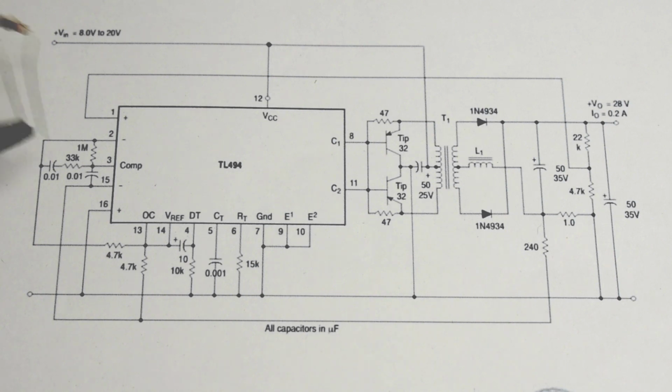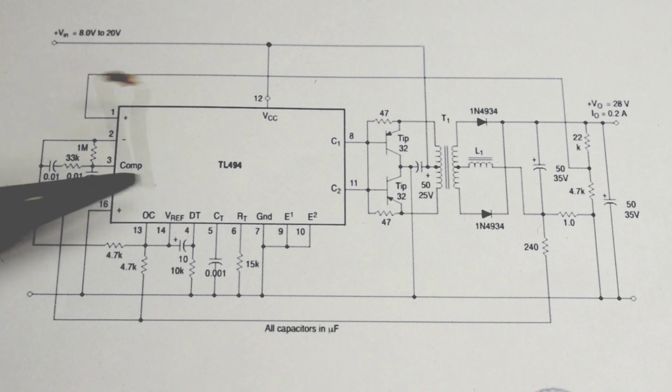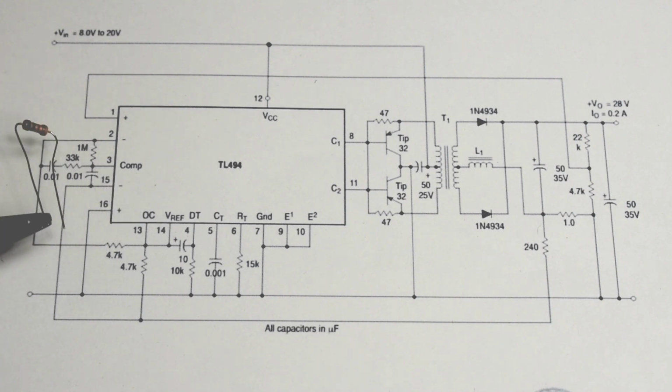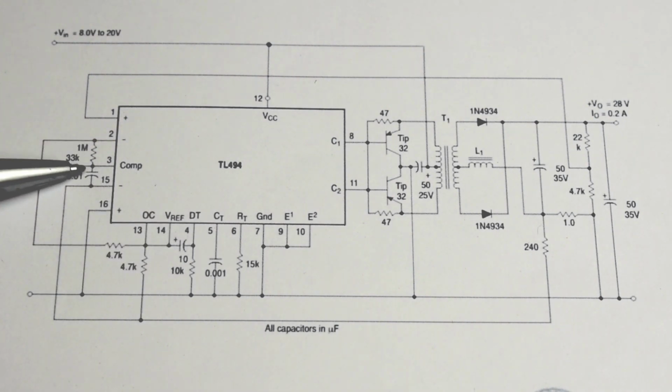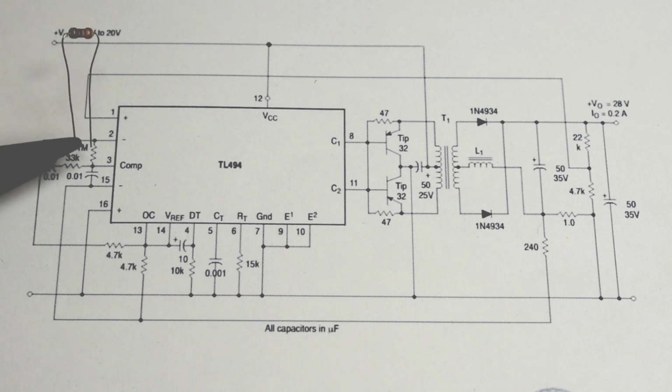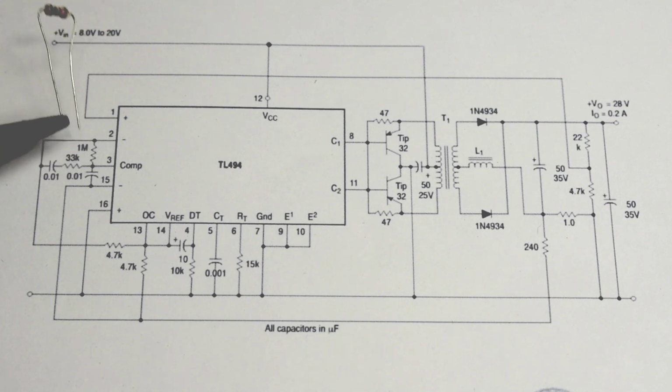Now if the voltage went lower, placing a 10K in parallel with the existing resistor, you know that you're going to have to keep increasing the value of the resistor to get the voltage to go lower and lower. If you want the voltage output to go higher, then the only thing you can do is desolder the existing resistor you tested using, and replace it with a resistor that has a higher value.